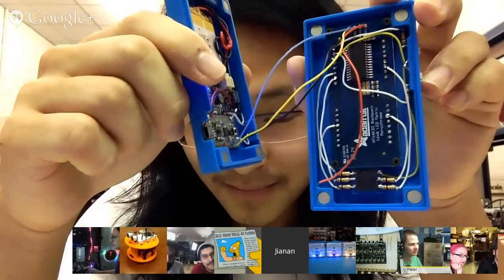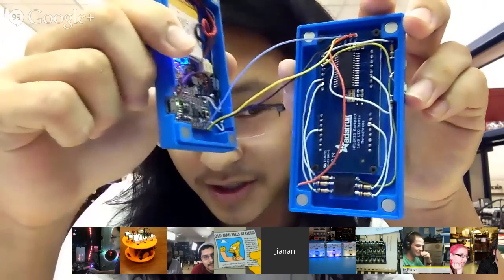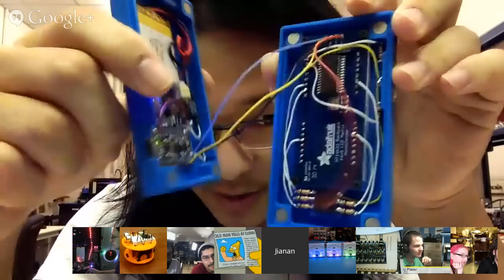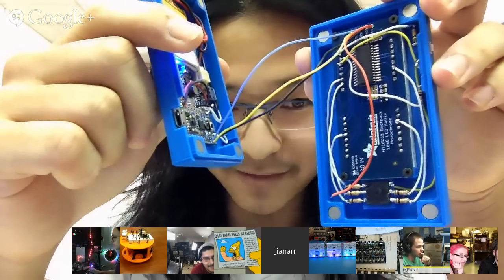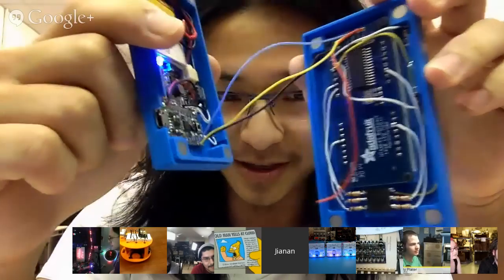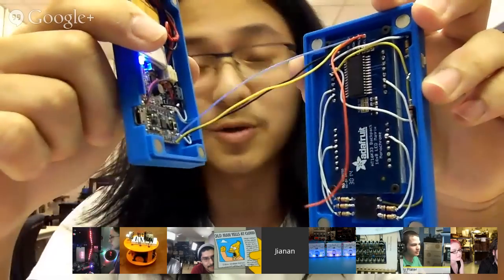And so I'm using the chip here, the HT16K33, to both drive the LED matrix and read the button states. So it saves us some resources, and I don't have to manually debounce. I don't have any debouncing code on this Pro Trinket. I just have to read button states from that chip over I2C, which is kind of nice.